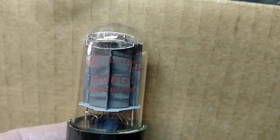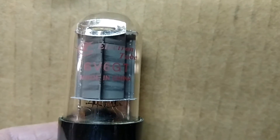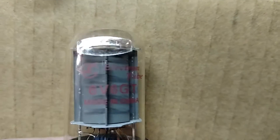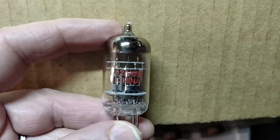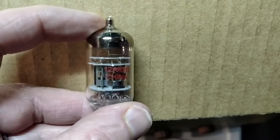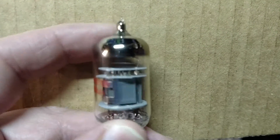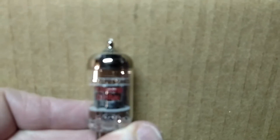I've removed one of the tubes — valves — and it is an electron tube, 6V6, made in China. No discernible brand on it. Same for the preamp tube, a 12AX7B — not A, but a B — also no discernible brand name, other than made in China.